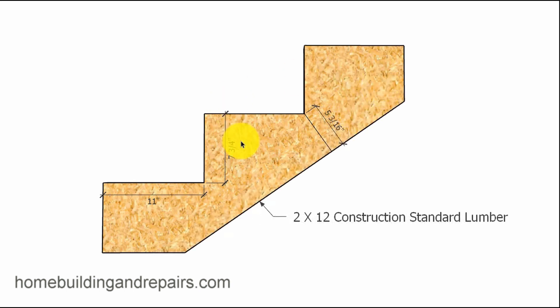That won't be necessary if you use a 2x12. Here you're going to have about 5 and an eighth of an inch. Five inches seems like plenty of lumber for structural strength. Three inches is probably not going to cut it, especially on a longer set of stairs with no support braces underneath it.